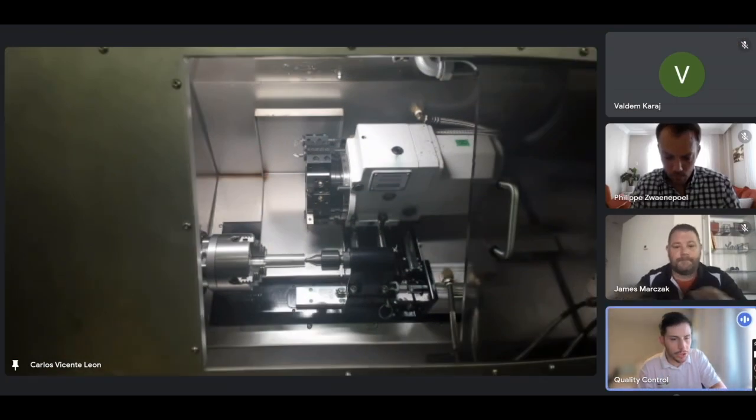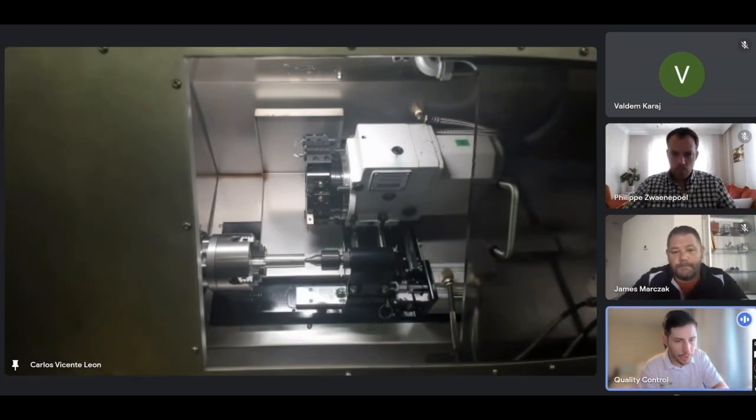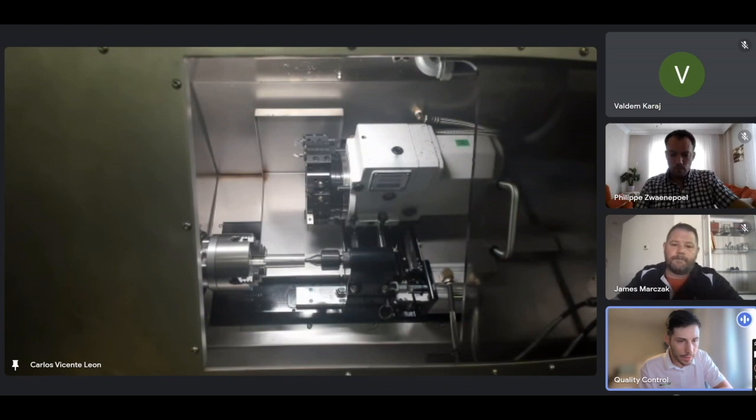So James, in terms of our current controller, it is Mach 4 based with the 32-bit foundation, with the interface running on top for Tensile. We do have future expansion plans to bring in a FANUC controller. In fact, in the very near future, it'll be FANUC based with the overlay. So right now we're still sticking with the Mach 4 base, which all of our customers have, which allows us to remote access the computer if we need to do updates and control it from headquarters. But in the future, it'll be FANUC based, probably January of 2024.